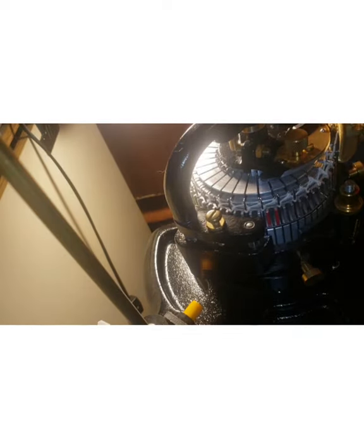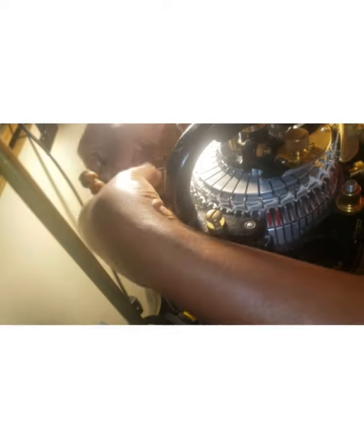Now, I seriously did myself a favor. When I took the cylinder needles out, I laid them all in the same direction so I can just grab a handful of them with the butt end facing out, because spending time turning them upside down actually slows me down. Rotating was easy, but turning them around, you'd be surprised how many seconds I shave off by having them already in the same direction. It's little stuff like that.